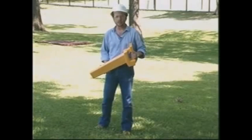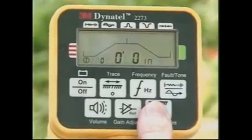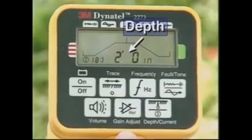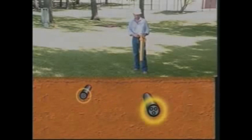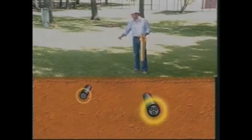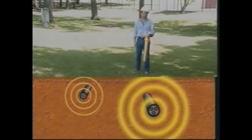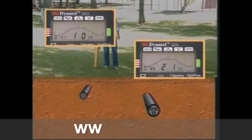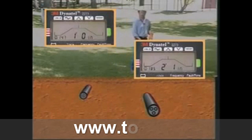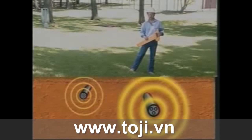At any time while tracing, you can get an estimate of the cable's depth. Set the receiver on the ground directly above the cable with the receiver's handle in line with the cable path. When you press the depth key, the numeric display shows the estimated depth and the relative signal current in the cable. The current mode is useful for verifying that you're tracing the correct cable. Here, the transmitter signal was applied to the deeper cable. The other cable is carrying a weaker signal because of common grounding. Since the cable with the highest current is most likely the target cable, you have to check each response in the current mode. The deeper cable has the highest current and is the target cable. To reduce the possibility that the trace signal will get onto other cables, use the direct connect method at 577 hertz with good far end ground.